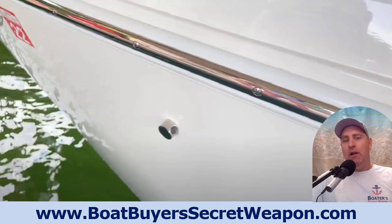Man, what is it? Well, it's actually a vent for your fuel system. It's why ethanol is so bad in boats, because the fuel systems are open to the environment. And this is another part of the fuel system. This is a little bit different looking, but this is actually the overflow. So if you overflow your boat with fuel, you can actually have the fuel spray out of this little part. You can see it's kind of facing upwards so you don't get water rushing into it. That's what those two are. They're part of the open fuel system, or the vented fuel system.